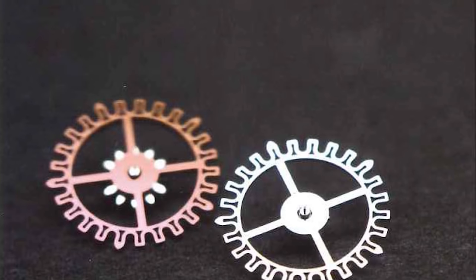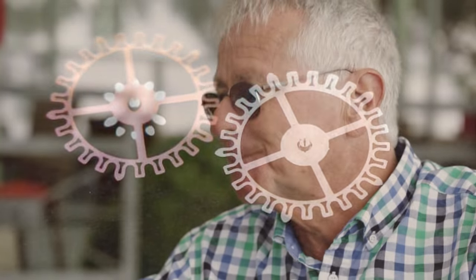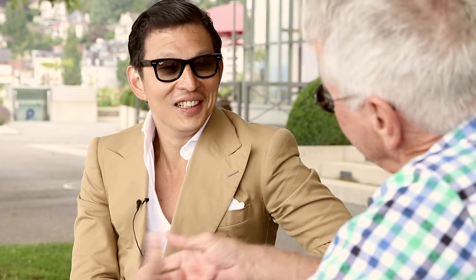To speed up and stop. So we first tried to prove that this escapement would work with a light material — we made it out of aluminum. But we knew aluminum would not be reliable because it was too soft. Then I discussed with my friend, the teacher at the École d'Ingénieurs, Michel Vermont. He told me, 'You know that you can make micromechanical parts out of silicon.' I was familiar with silicon from working in electronic circuits for microelectronics, but not for micromechanical parts. So I said, good idea — I'll go to the CSEM and try to convince them to make some samples for me.